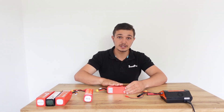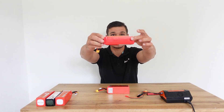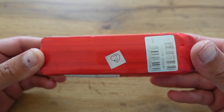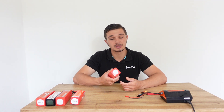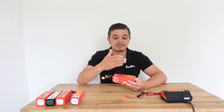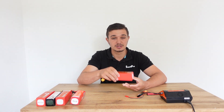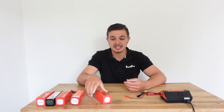The easiest way to compromise these batteries is to not put them in storage mode. If the battery is left fully charged, the cells will react and the battery will essentially swell up — it will look like a rugby ball. If your battery swells up, discard it immediately as it is a fire risk. Do not keep swollen batteries. The other thing that could happen is if you fly the battery completely flat and leave it below the storage threshold, the battery will self-decay due to lack of reactivity. A flat battery is just as dangerous as a fully charged battery.